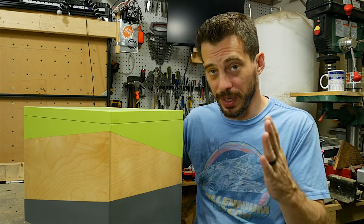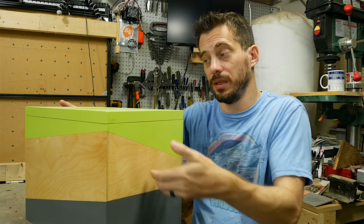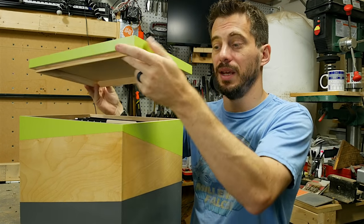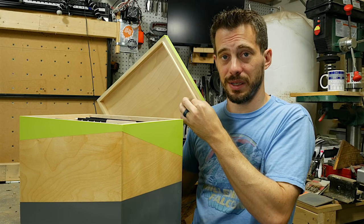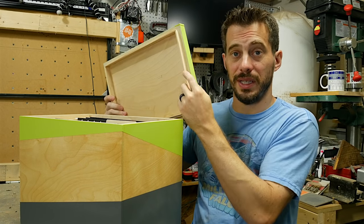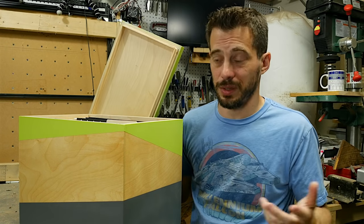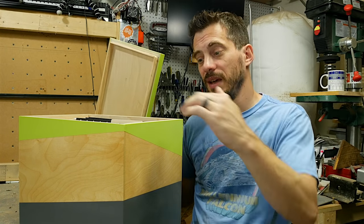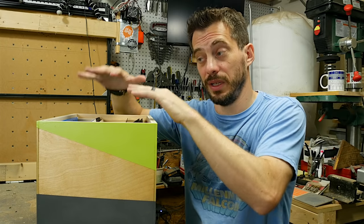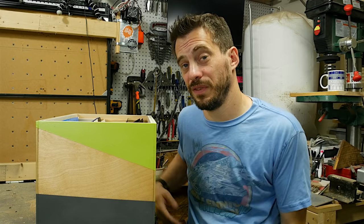We didn't actually need any handles, but if you wanted them you could screw them onto the side or cut a pocket in the side so you could stick your fingers in. You could also do the same on the top to make it really easy to lift the top on and off. If your top sticks, you can add some wax to the outside or just sand it down until it's loose enough. If you didn't want to add a lip, you could put some hinges on the back so that it would hinge open. This thing is basically just a box, but the difference is having a little track on the inside to hang the file folders on. And if you have more files than fit, all you have to do is extend the side — make the whole box longer and fit as many files as you want.